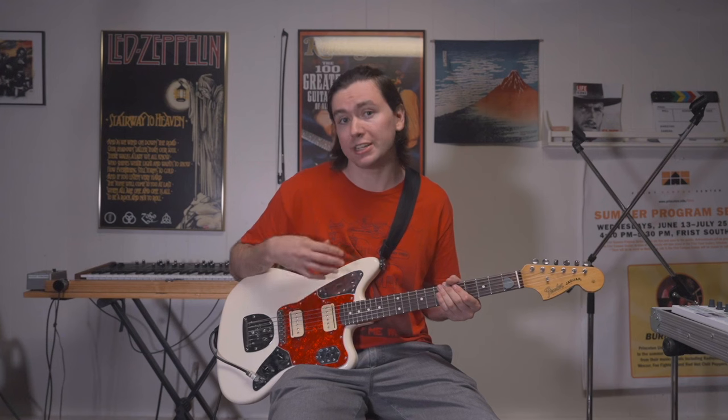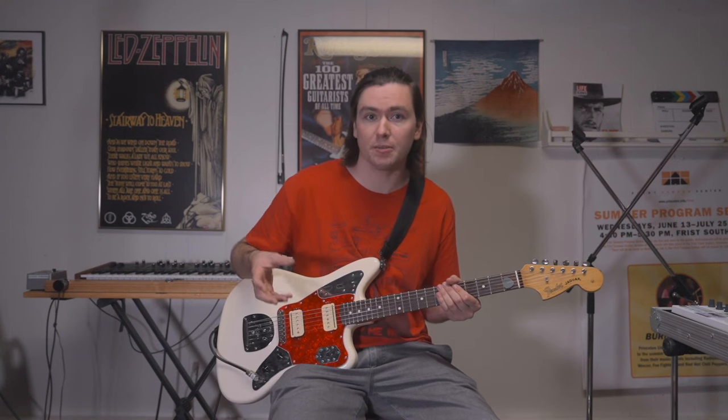Now, there are a bunch of ways that you can install this pickup to access the splitting and routing capabilities. One of them is a pickup ring that Duncan sells called the Triple Shot, which has mini switches on it that let you choose series, parallel, or either coil separately. I briefly attempted making these work with my Jaguar, but I found that the little ribbon cable and PCB were very delicate and broke easily, so I returned them and decided to do my coil splitting the old-fashioned way